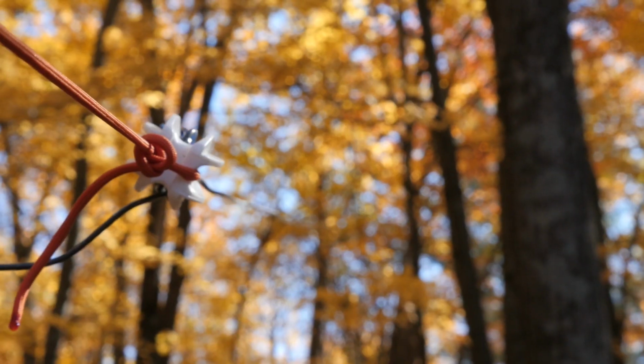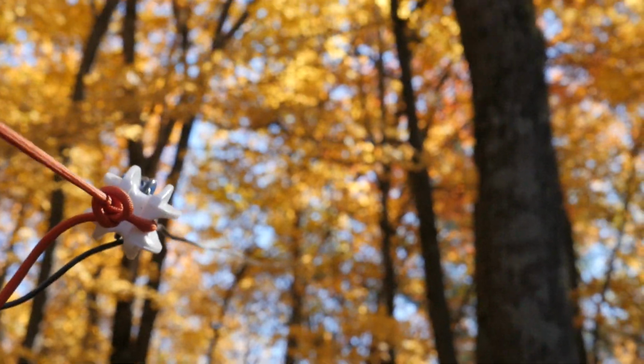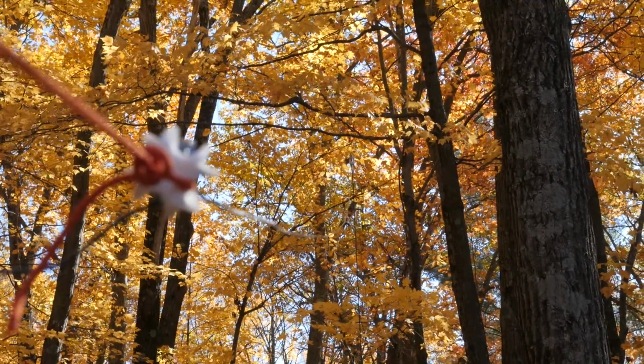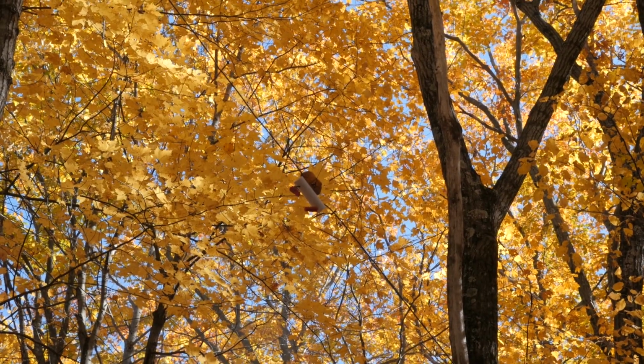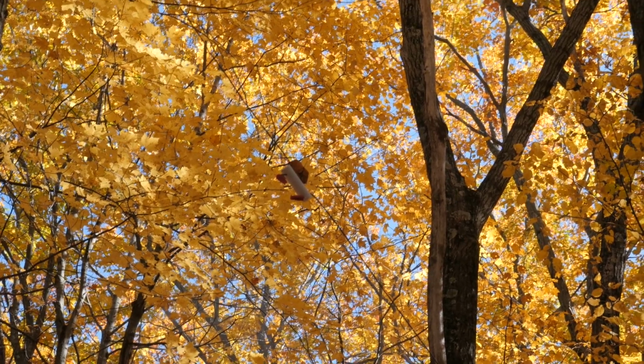Basically, what a link dipole antenna is, I've got a 40 meter dipole antenna, but at the 20 meter point there's a split so that you can disconnect and reconnect the antenna to lengthen and shorten it depending on if you're using the 40 meter band or 20 meter band. The antenna's been working great for me, so these last few activations, if I've got the space and the trees to put it up, I've been using it and having fantastic results. So that's a little bit about the activation here, and let's see what we're planning to do. Let's make some noise on this Parks on the Air activation of K1442.